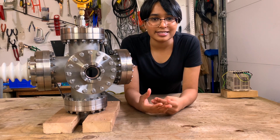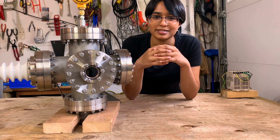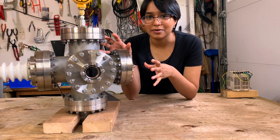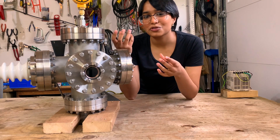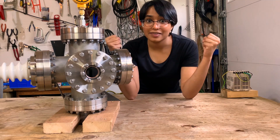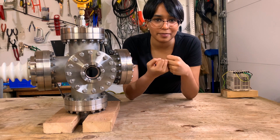The inner grid is negatively charged. It's a sphere of tungsten wires connected to a negative 30,000 volt power supply. When deuterium ions are inside the chamber, they're positively charged, so they accelerate towards the negatively charged inner grid, where they have a certain probability of colliding head-on and fusing if they overcome the Coulomb barrier.